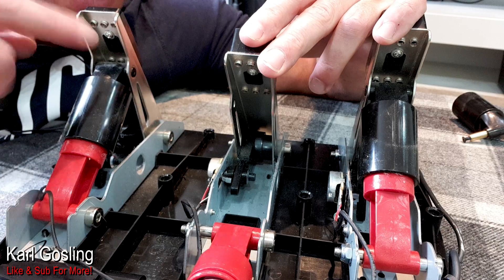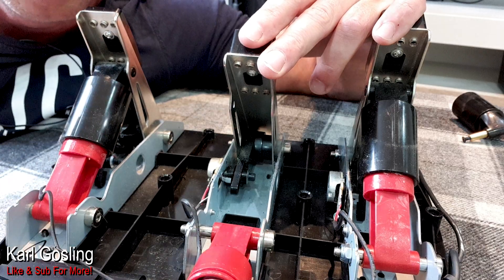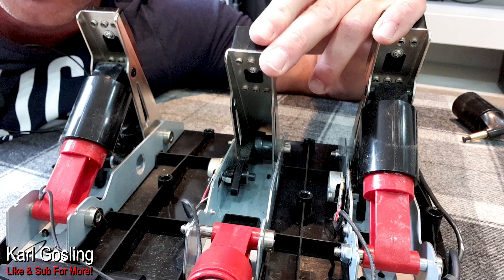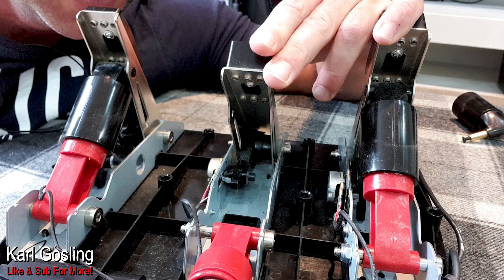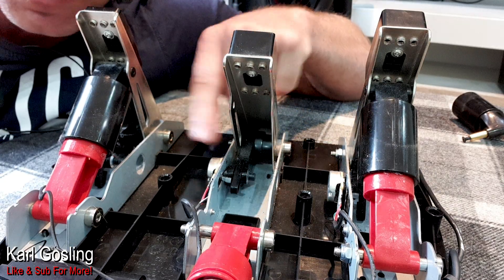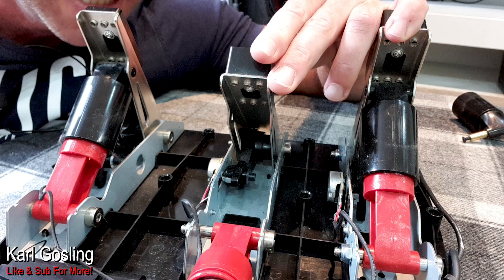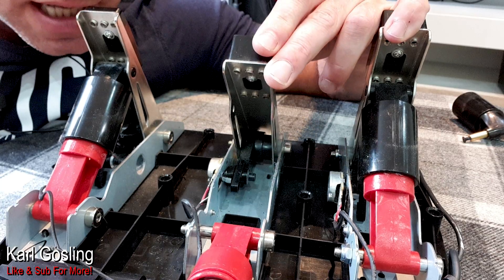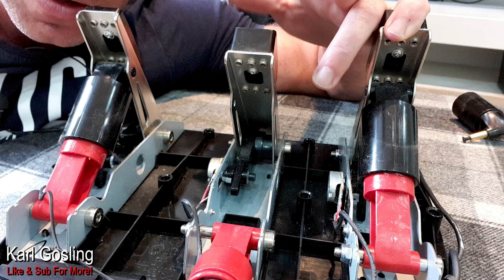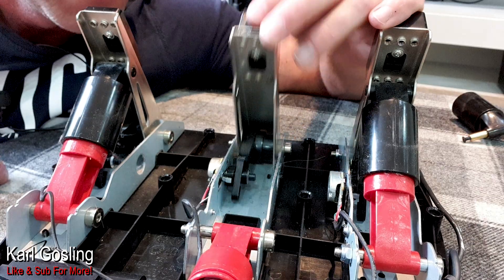That's a potentiometer — an example of one type. As I mentioned in the previous video, you can have slide potentiometers like you'll find on crossfaders and upfaders on DJ mixers, and then you'll find other types of linear potentiometer like in the AXC sim mod where they slide in and out in the center of a barrel type position. They're all potentiometers — they all work in the same way, which is also why the AXC sim one just plugs straight into these three wires. It doesn't care about pressure or force; it simply varies its resistance based on the position of the pedal.